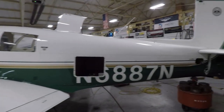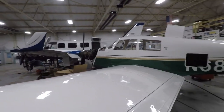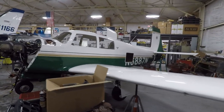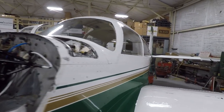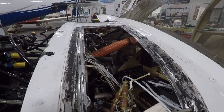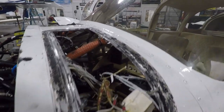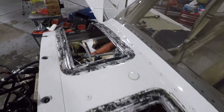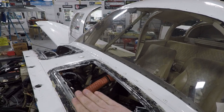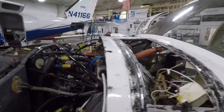We're going to walk around to the front and work our way into the spaghetti panel because they are doing the Dynon system we talked about, with the Avidyne 540 also going in. We ran into a couple of hiccups, and I'll explain that a little later. But here is the good thing with the Ranger: all the avionics plates are on the outside of the airplane, so it's easy for them to get access to the wiring and the harnesses on both sides. If you had a 201 windshield, the windshield will come down and kind of block that. And then you guys really take the whole panel apart and do a lot more work to get to the wiring and to the trays. But that's basically it on the top of the airplane here.